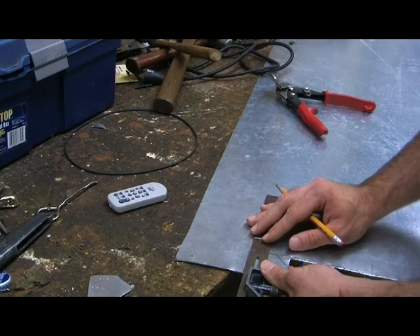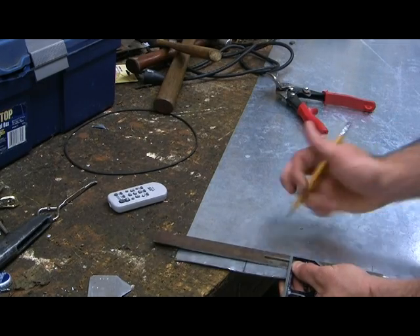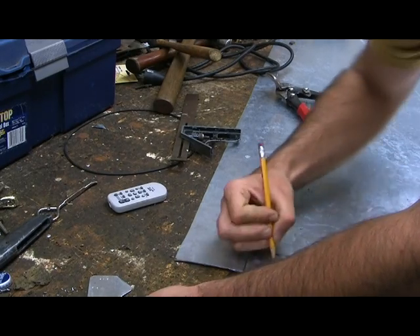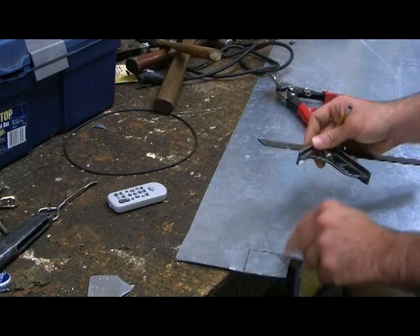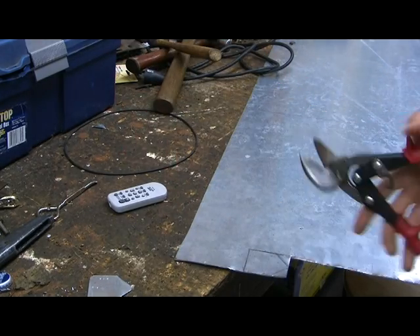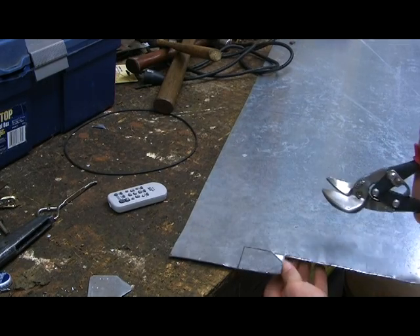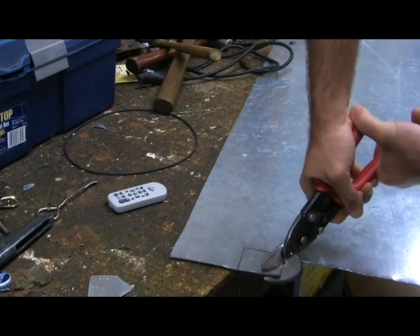Try to line it up and make it as straight as possible, keeping the ends straight. On the bottom — the part that will be shown — try to make it as straight as possible. The ruler can't really reach into the angles on both sides, so don't go crazy about that. Now get your regular pair of cutting shears — your tin snips — and cut the piece. You can use these to cut the whole thing, but trust me, I learned the hard way: it really hurts after a while and it's not worth it.